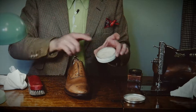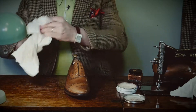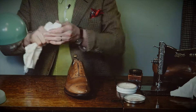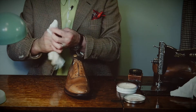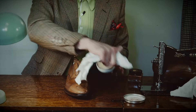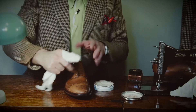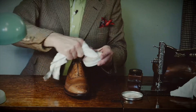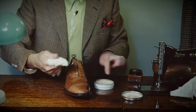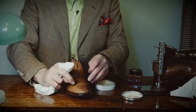I'm going to use entirely clear polish and I'm going to be mixing this with water. Water's important — it stops the polish from dragging. I tend to wrap the cloth around one finger, keeping a nice flat piece of cloth on the tip. I'm going to take some of the clear polish and dip it — there's a little bit of water in the lid from the polish tin. You can apply it straight from the tin, but it's very hard polish and it tends to drag on the surface and you get little lumps — it clags up. If you mix it with water, it reduces the friction and really allows you, as you're rubbing, to glide more easily.